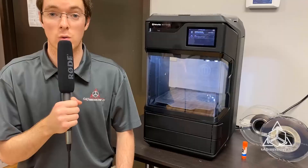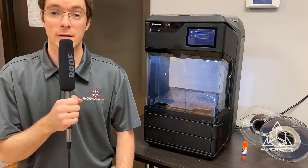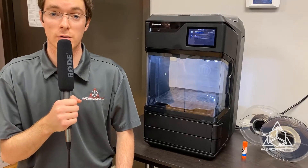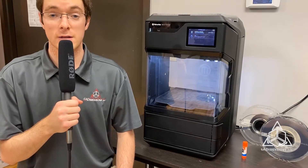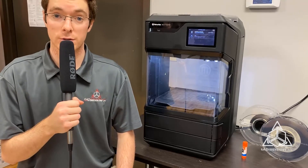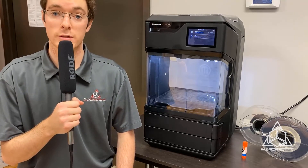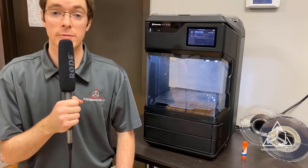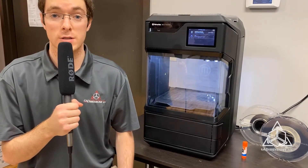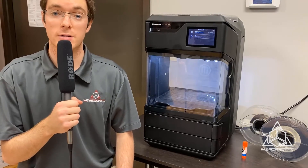They print using PVA support, a water-soluble support from MakerBot. Like all nylon-based materials, they're affected by moisture and should be stored in a dry location. Nylon CF has the highest peak performance in all categories and is significantly affected by moisture, while Nylon 12 CF will retain its performance in the presence of moisture. The carbon fiber materials with the MakerBot Method are great for small to medium-sized prototypes, jigs and fixtures, and end-use parts.